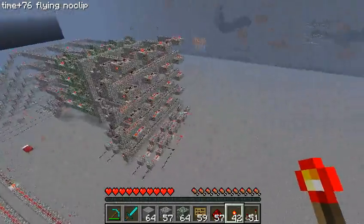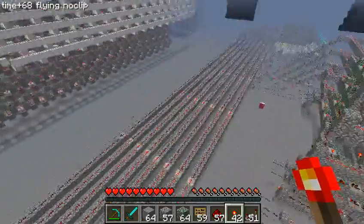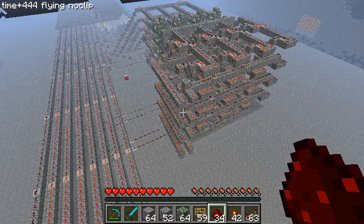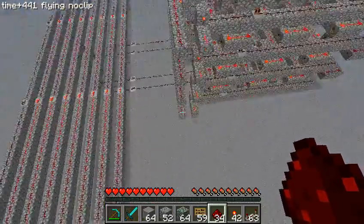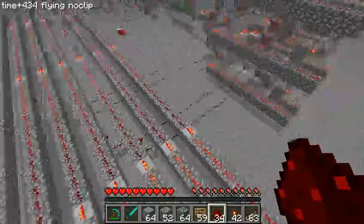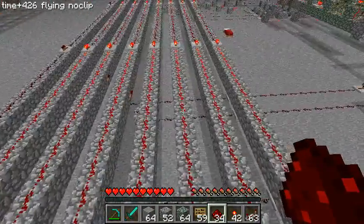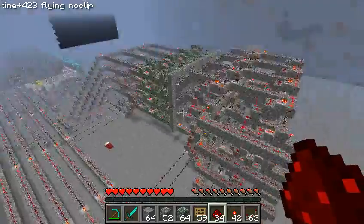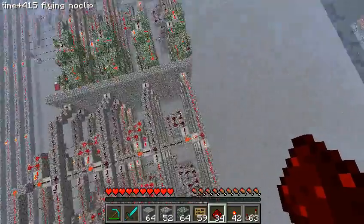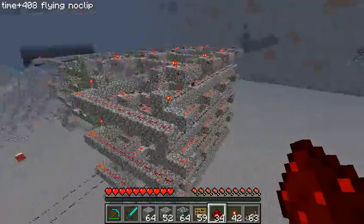All I have to do is build a second MUX, so we've got two MUXes, and connect those lines up to the inputs. I've made the second MUX, extended the buses down a little bit, and connected the inputs to the main instruction bus. You can see currently, whichever instruction it's on, it has all reds over the middle four, indicating the fourth register on both. This dark tower and this dark tower indicates that the fourth one is being read from both, which is why both buses coming out of here are all red.